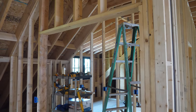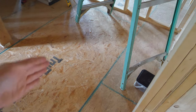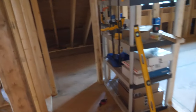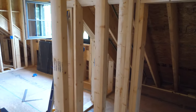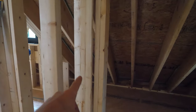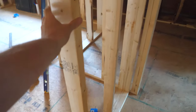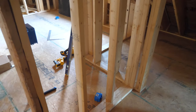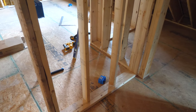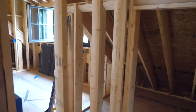I just finished framing out the rough opening for the pocket door — the track's not in yet. Inside the pantry, pretend there's a wall here because the pocket door takes up double the room that a regular door does. This space right here I had to go from a 2x4 to a 2x6 wall, so I just added a 2x furring strip to fur that 2x4 out to the 2x6 width. I left these 2x4s here because I knew I was going to need some sort of niche here — I think this would be a really awesome space to store canned goods and mason jar goods. It's about four inches deep — like the perfect depth for a shelf.